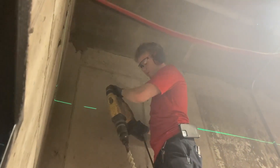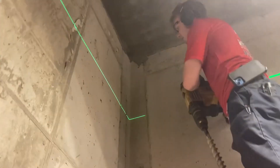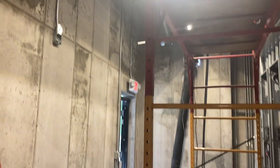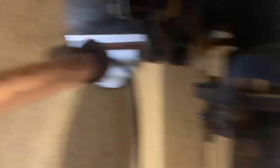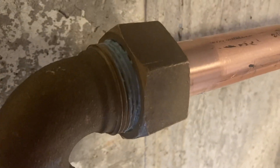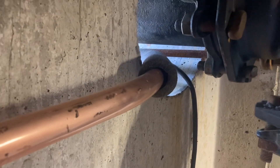Safety first. Ready to drill two holes through there? Let's get it. We've got our one-inch K inside the building, our first one-inch compression 90 on here. We're going to go straight down, put the meter in, start running pipe into the next room. So far so good.